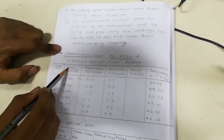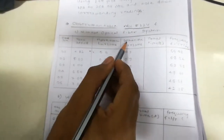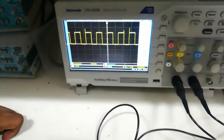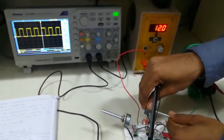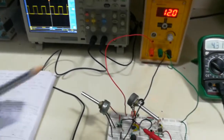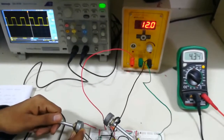In the observation table, you have to vary the voltage at pin number 5 — named as V-control. You have to determine the mark time (T-on) and the space time (T-off). Let's see how they vary according to the 10k pot adjustment. At 4.32 volts, this is the position of the wave.